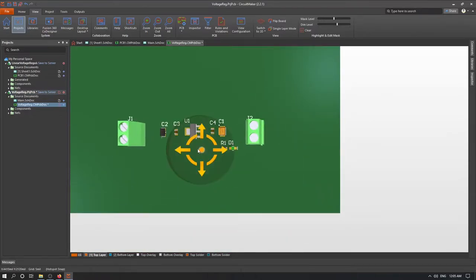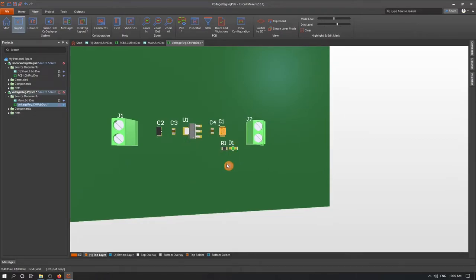Let's check our 3D view right now — it looks pretty good. Now we need to make a choice: do we want this board to be one layer or two layers? If two layers, we can route signals on the top layer and use the bottom as ground. But if we want a single-layer design with screw terminals, we need to use only the bottom layer, because the screw terminal pins must pass through and be soldered from the bottom. Therefore, all SMD components need to move to the bottom side.